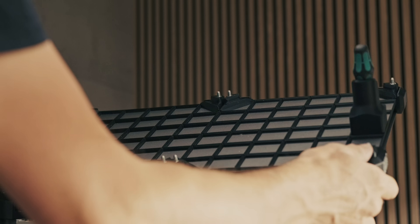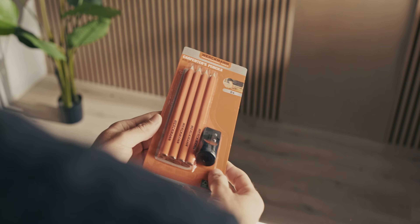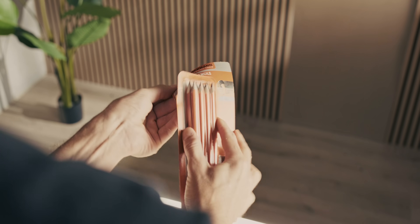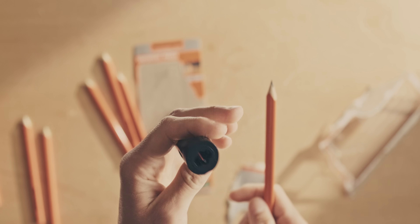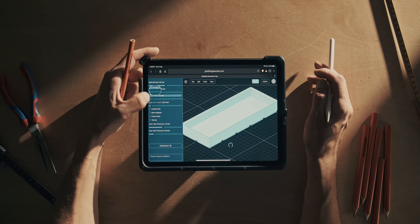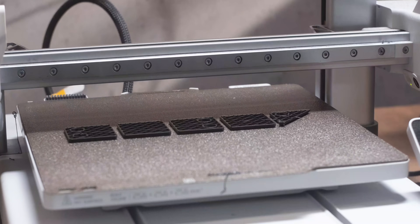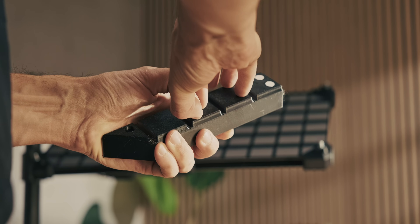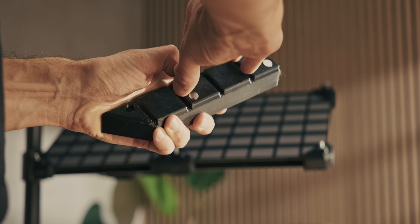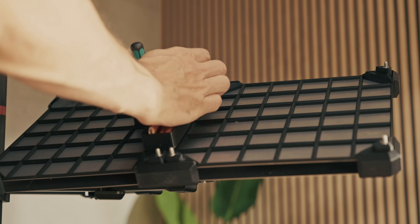When I printed it all out and put it in its spot, I noticed there is quite a bit of wobble on the project panel and that has to do with the weight — it's quite a lot lighter than the other panel. So even though it looks a little bit more solid, it doesn't feel as solid as the other ones. The next thing I'm implementing is something I should probably put in every project panel: pencils or some kind of marking method. In terms of the magnets I'm putting in here, I'm using 10mm magnets which the Gridfinity generator doesn't actually support — it goes up to 8.2mm, and 10mm is probably a little bit overkill. It really snaps on there very solidly, which is nice, but it's not as cost effective as using smaller ones.